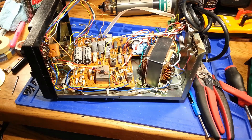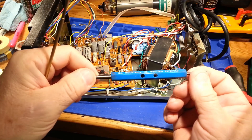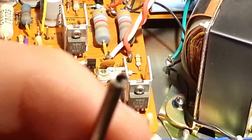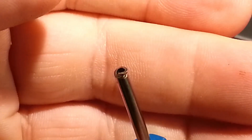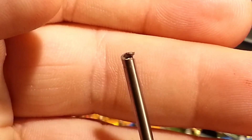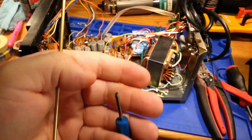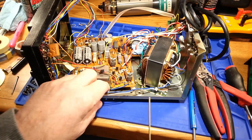And that being said, I'm going to go over making up a cheap tool for an unwrapper just to be able to handle wires coming off a board. There are some tools on the market. One of them is an OK Industries wrapper, a combination wrapper and unwrapper for 22 and 24 gauge. The thing about this particular one is the unwrapping end has a kind of corkscrew threaded fashion hook on the end to grab a wire and remove it. But the problem with this particular unwrapper is when you go to grab the wire it tends to spread the top of the connection out to the point where it loosens it up a lot.